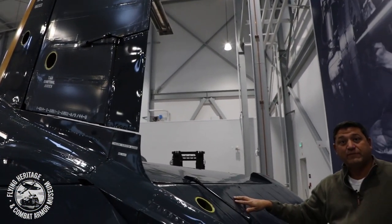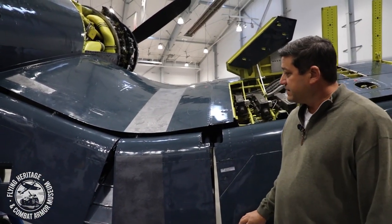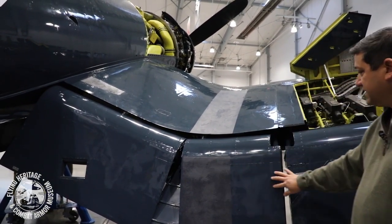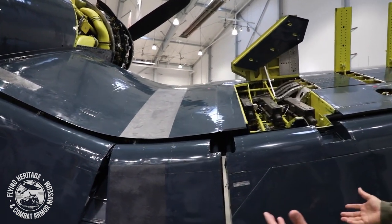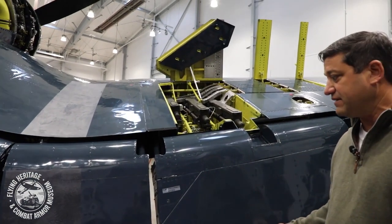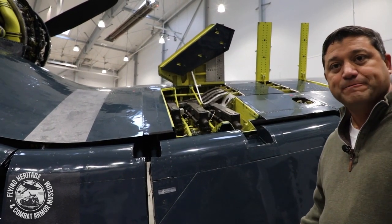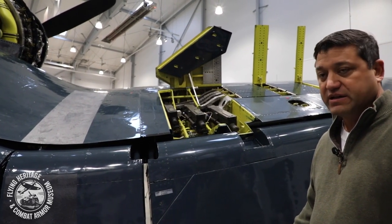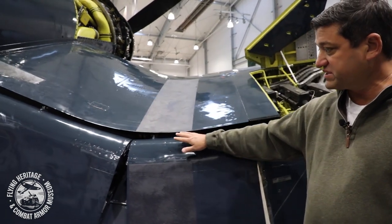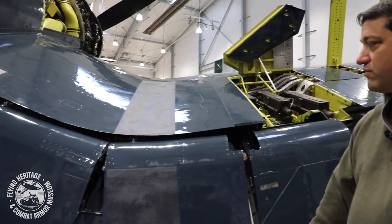The wing flaps are made of metal — you can see there's grip walk here, so it's okay to stand here on the aircraft. The right wing flap is actually three different sections. Inside and out, you're checking for rivets and cracking of skins and stress caused during flight. With all of the linkages — big push-pull tubes and connection points — there's quite a lot to look at just in the wing flaps alone.